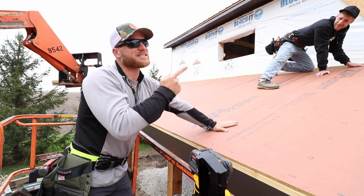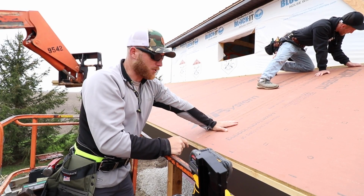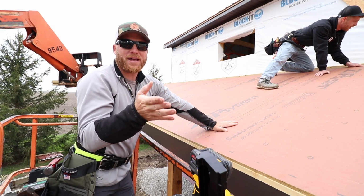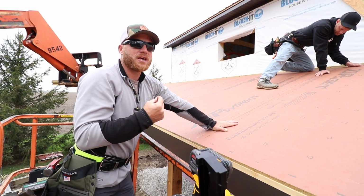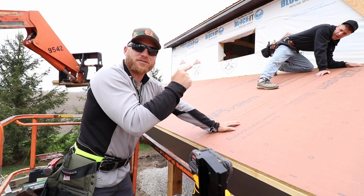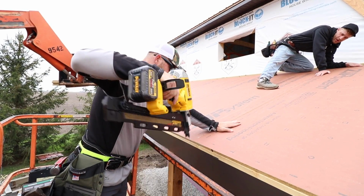However, on a 16-foot wall, there could be some movement in and out because lumber's not perfect. So where we attach all these rafters, we do all the measuring and make sure it's as good as possible, but we can still be off just a little bit on our rafter tails. We like to run 2 sheets of plywood, which is 8 foot at a time. That gets us from tail to tail. We know we're perfect, and then we straighten that fascia out in the middle.